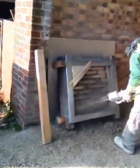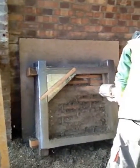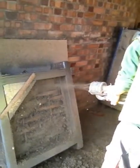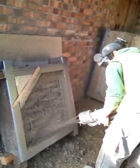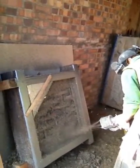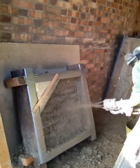So this is spraying the test panel which would have originally been wattle and daub, and it works really well. You can see the slurry and the binder are mixed at the nozzle for ease of replacing, and you get a fantastic bond with the timber. It looks wet when it's applied but the hemp absorbs the majority of the free water in the mix.